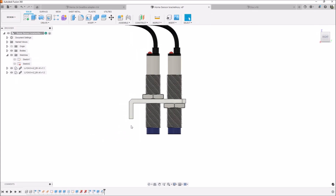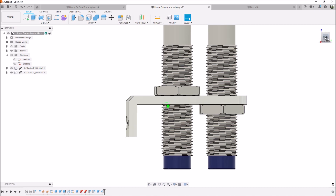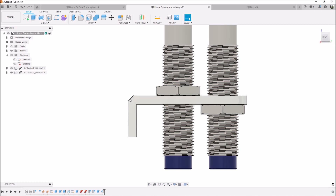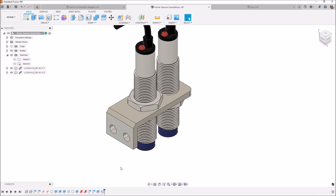One other thing I wanted to note is the way this mounts onto the hub of the tool changer. I had to cut the corner off and put a little chamfer on here to give it some clearance, because right here is where the hub splits and the two pieces rotate — so I needed that clearance for that to happen. Let's go out to the Precision Matthews and machine this little bracket out.